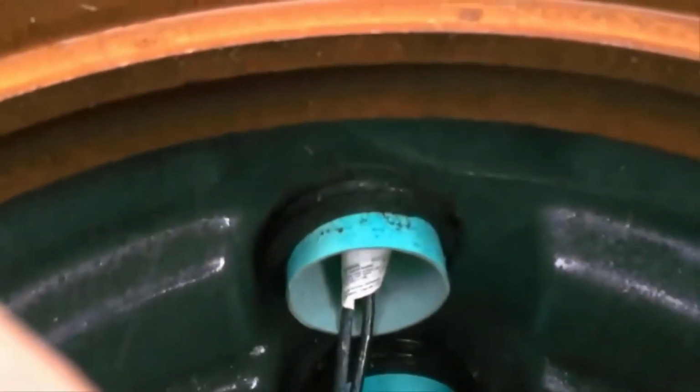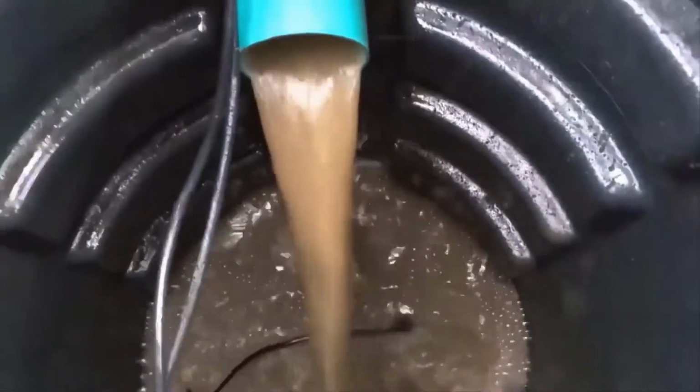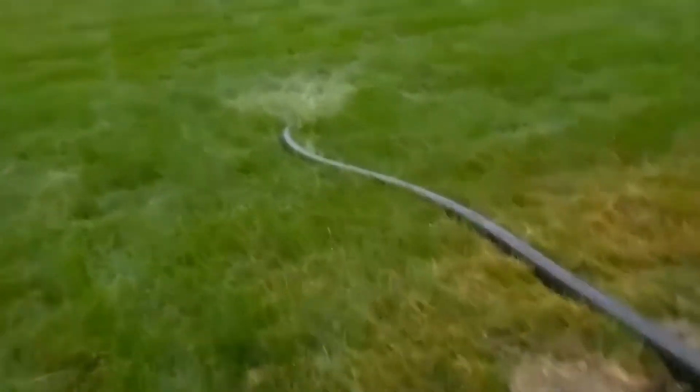It wasn't in long. But look at how much water. Now you can see that Liberty pump at the bottom. The cast iron Liberty pump just disappears. The water fills up so fast. Those rubber seals, no dirt's coming in between the pipe and the basin where we use the hole saw. That's what's really nice about those rubber grommets. That's why you see us using those.